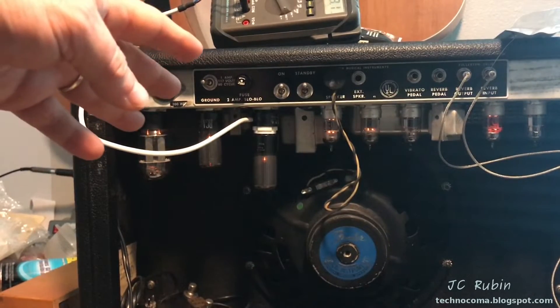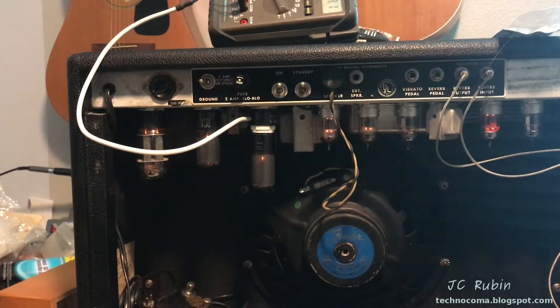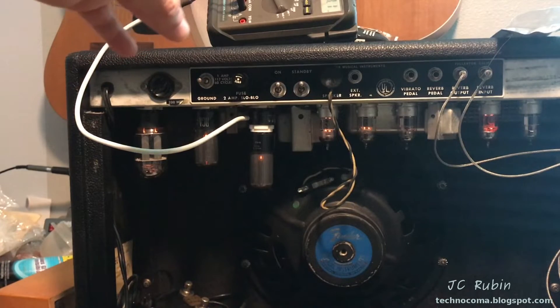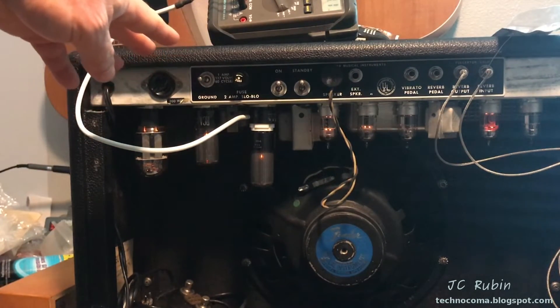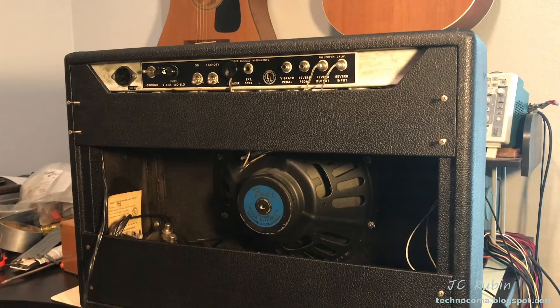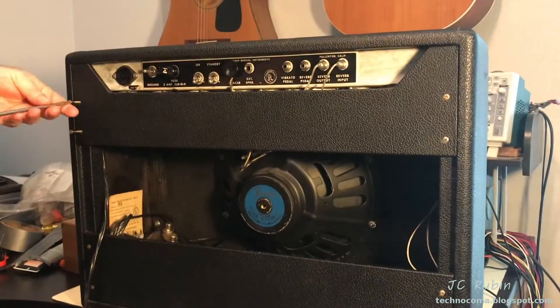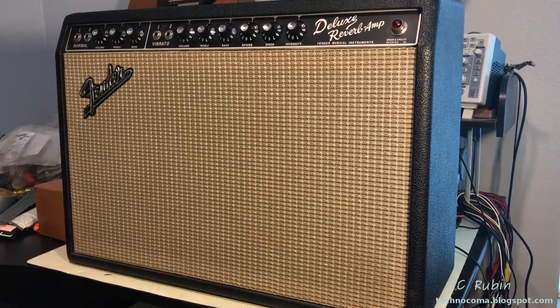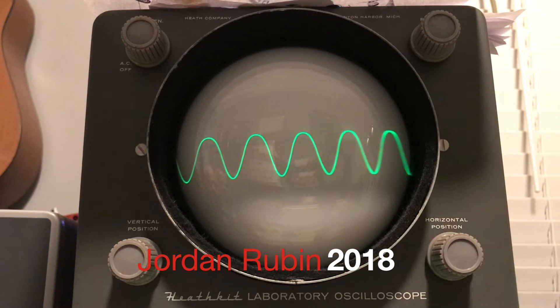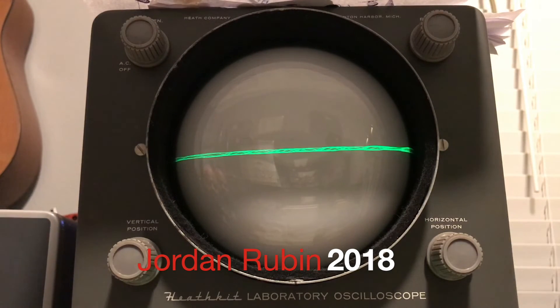I've heard back and we're going to go with this — if we have any more problems with the pot, we'll replace it. I've reassembled the amplifier and as usual I'm just checking the bias to make sure everything's okay. The voltage runs a little hot at the shop so I dial it back on my setting. Both tubes are evenly matched, which is exactly what I want to see. I'll just put the back cover back on and we'll be finished. I hope you enjoyed another quick Fender Deluxe Reverb repair — thanks for watching, and we'll see you next time.